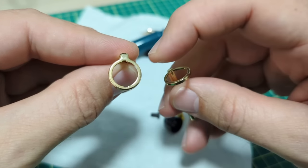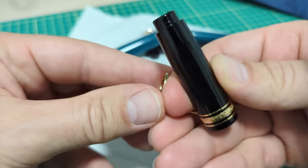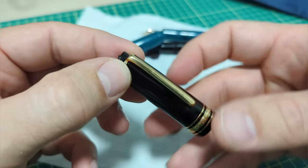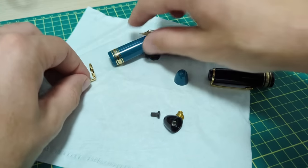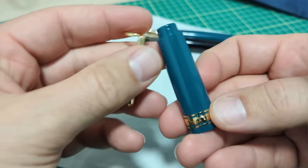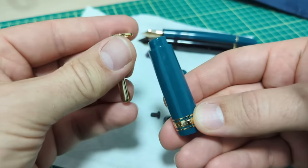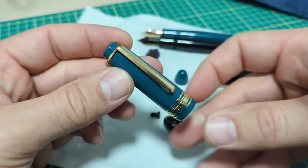Comparing the clips tells a story of how you save a few dollars. On the Montblanc, the polishing prior to plating is superior. The Wingsung clip is essentially stamped out in one shot. Where the Montblanc has a little rounded end connected quite nicely, the Wingsung forms that feature by bending during the stamping process. One smart detail on the Wingsung - the clip has little tabs that align with notches on the injection-molded body, so it lines up every single time.